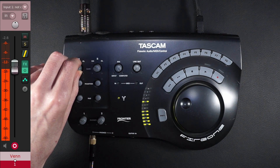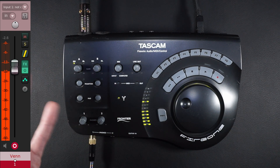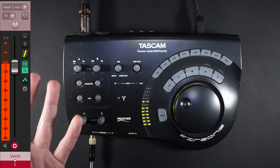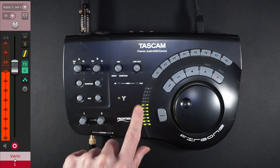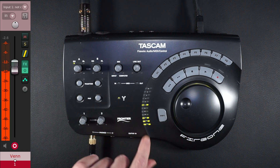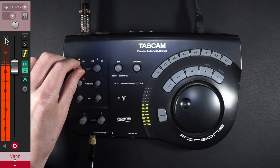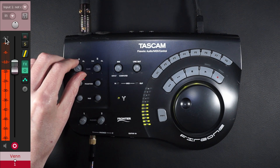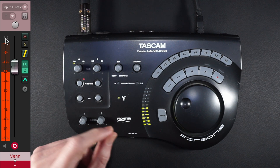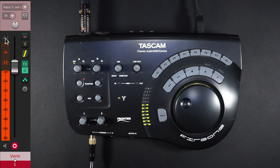Check one two. We're trying to get up to minus 18 dB and we're about there, but we're almost completely out of room on this preamp. These preamps only have 53 dB of gain each, but this is an Amazon basic dynamic microphone and it requires about 56 dB — and I'm holding it right in front of my mouth like a hand mic. It'll get the job done. Now trying it with the condenser — the Audio Technica AT2020, the old podcasting classic. Not really maxing this out; all the gain seems to come in on that last little bit of the preamp, which is not uncommon. We're hitting minus 18 dB. That's good.